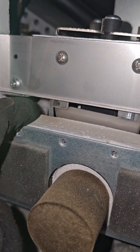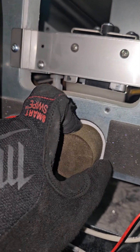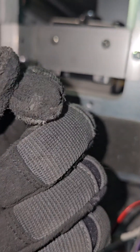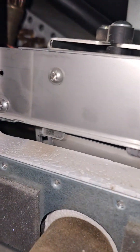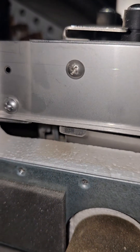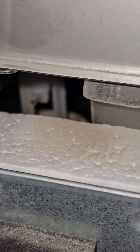You can look right here and see the float — there it is, the float assembly right there. That piece goes down, it's attached in the corner. Usually when replacing the pump you replace the pump and float assembly, but oftentimes it's just sludge in the pan. The pump inlet opening is very small — about the size of my fingertip — so sludge and dirt can easily clog that inlet, the pump stops pumping, water builds up. You can clearly see that float is up.